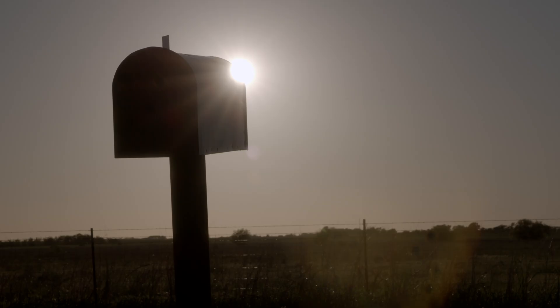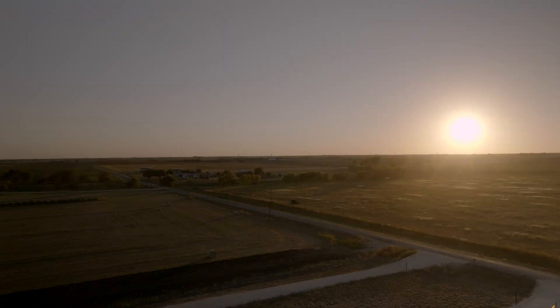The other thing you can do to make it high performance is insulate your slab. Down here in Texas, does it matter? From a comfort standpoint, absolutely — the edges of our slabs get cold. If you're walking barefoot in your house and approach your exterior walls in the winter, they will be cold. From an energy usage standpoint, it matters some — it's cold, it's taking energy to heat that up and that's going outside. It's a little bit harder to justify down here.